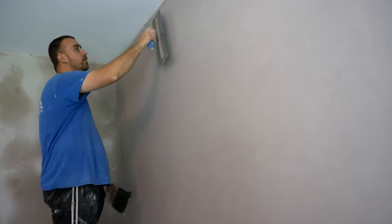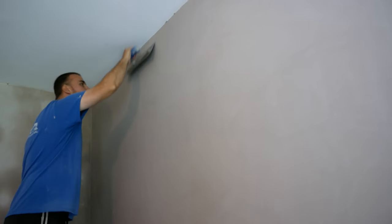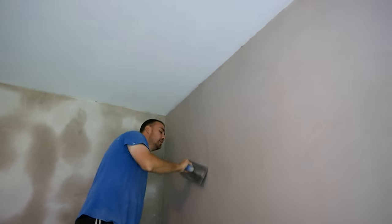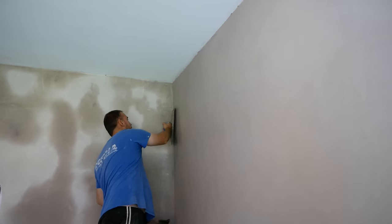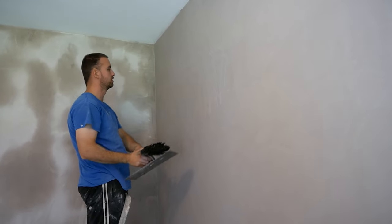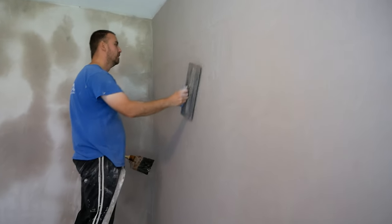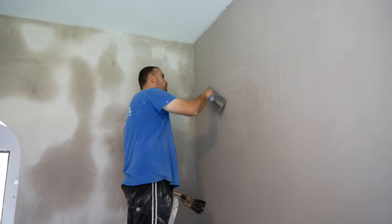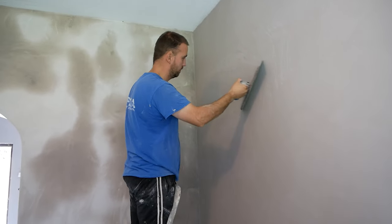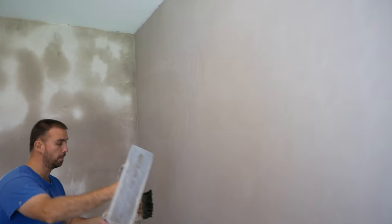Because the wall is pretty solid. If there are any tiny little holes, now is definitely the time to get them, because after this pass the wall is going to set up. Just lower down on the wall where it is starting to set — it turns brown where it really is setting. Just like the stages beforehand, starting top left, I'll work myself all the way across to the right, just working the water down the wall. There's a lot more pressure and the angle of the trowel is a lot more open at this stage. You don't necessarily need another trowel after this stage, but we'll show it for the demonstration just in case you do want to polish the walls up.